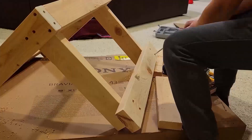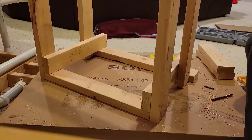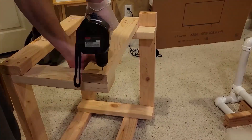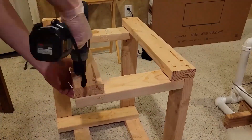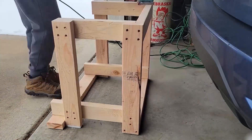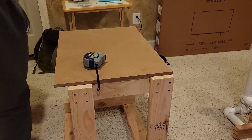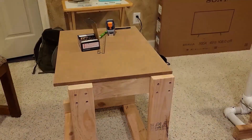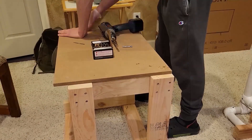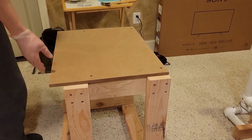One method I learned: instead of drilling through the upper plank and into the lower plank to mark where to drill pilot holes, I found it to be a lot better to focus on the upper plank until you're ready to put a screw in. Then, screw a screw into the upper plank so that it's just poking out of the bottom. From there, you can easily align the wood and press the two pieces together to get perfect markers on where to drill holes into the lower piece. Before I mounted the MDF board to the wheel base, I used the power sander on both the top and bottom of the frame to get it as flat and sturdy as possible. When mounting the MDF board, I used four 1¼-inch all-purpose screws, making sure not to drill in locations that might interfere with existing screws in the frame.